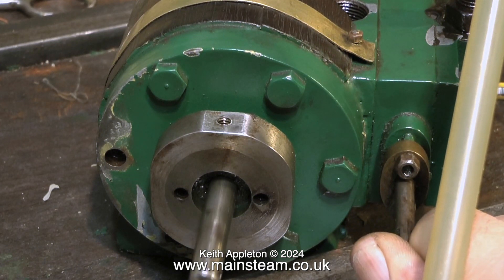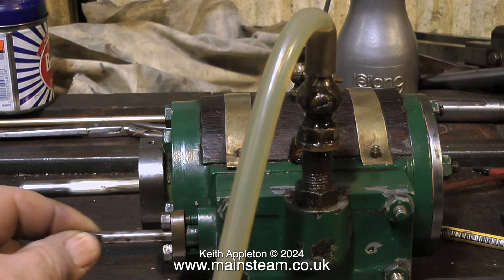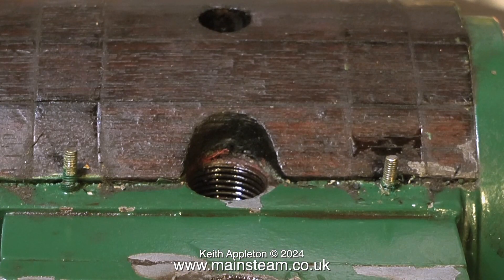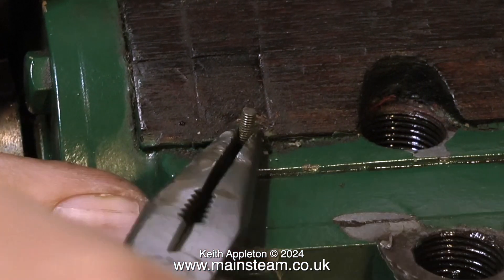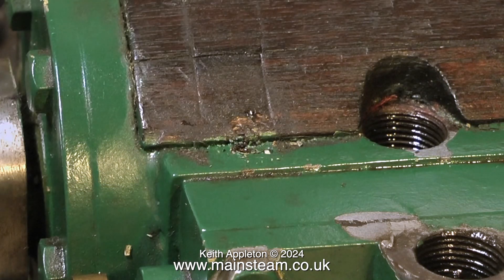As you can see, it's really successful — as I move the slide valve the piston responds perfectly and there are no tight spots whatsoever. I was so impressed I did it for a while. There's something good about what's happening here, poetry in motion from a really old, quite large model steam engine. The cylinder bore is now just below two inches in diameter, which should give plenty of power. Form follows function — if a model steam engine doesn't work and just sits on a shelf, that's no good.